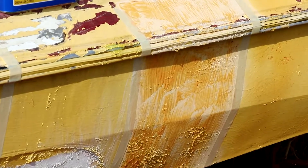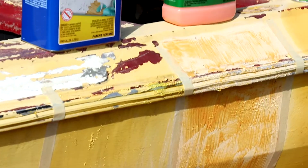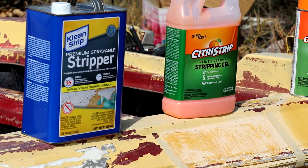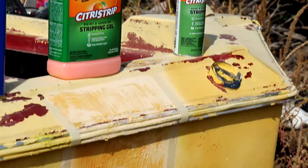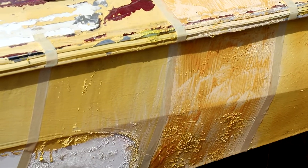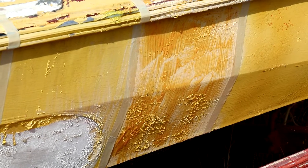It's been about 30 minutes. I was hoping I'd come back and it would all be sloughed off with no scraping at all, but let's see. Left to right we've got the Clean Strip premium stripper, the citrus strip, and then the aerosol version. They're all working — they're all doing some damage to the paint. I'm going to lightly scrape each area, rinse it, and see what it looks like, then make a decision from there.